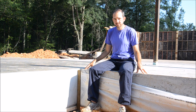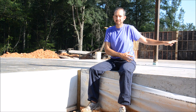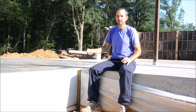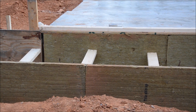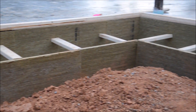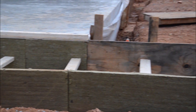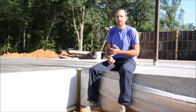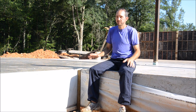Right here, this two inches is more than enough between these two slabs, because this slab is still insulated as much as the other one. But because this area over here is not mechanically conditioned and regulated with a thermostat — and this one is — we want to maintain a temperature over here, whereas this one can fluctuate a little bit. So this R10, or a little bit more than R10, of rock wool insulation is going to be more than enough to prevent or at least minimize the heat loss happening between these two spaces.